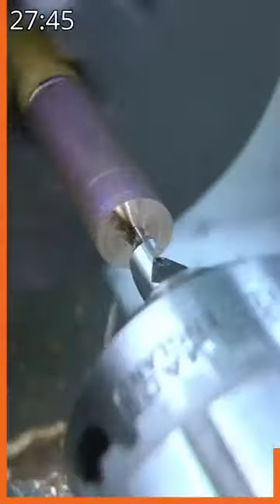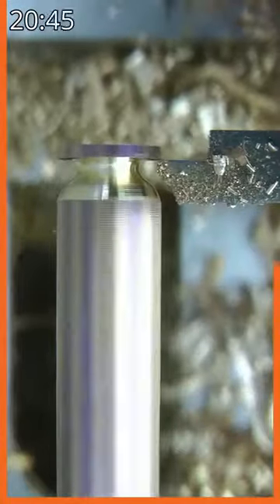Back on the lathe, I drilled a shallow 3.3mm hole and tapped M4. I shaped one side of the knob with a form tool and trimmed the unwanted flutes from the base.